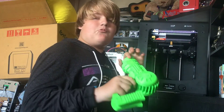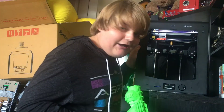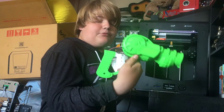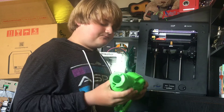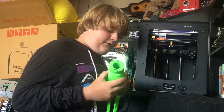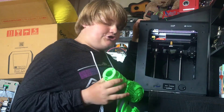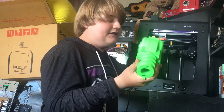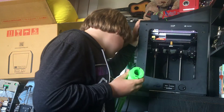You might wonder why one side didn't finish — the power went out. A feature this should have had is a filament run-out sensor, which it does not have. As you can see, print quality looks decent, but the issue is with over-extrusion — this thing over-extrudes through the roof. I'm running this at 100% flow and the prints are coming out pretty bad because of the over-extrusion.